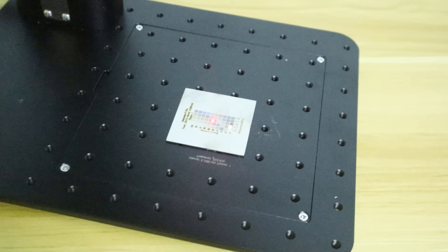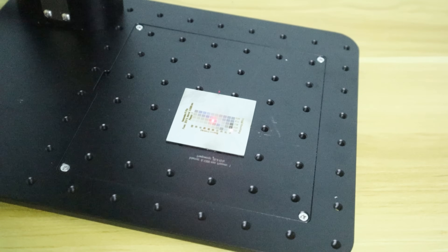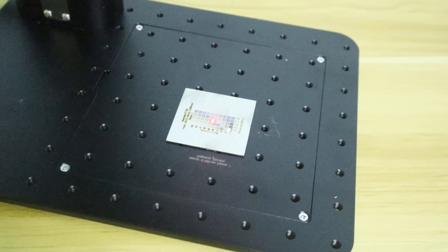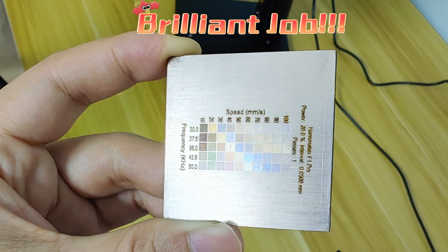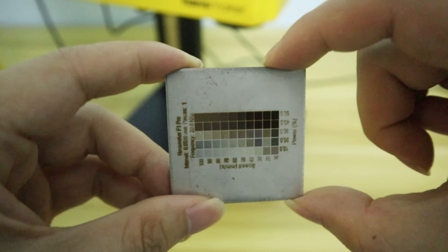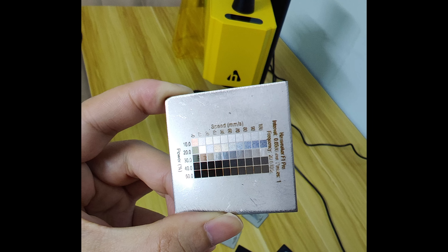I was able to achieve a very rich color engraving when I set up the test with the following parameters: laser power at 20%, interval at 0.05 mm, one pass, speed from 10 mm per second to 100 mm per second in 10 groups, and frequency from 20 kHz to 50 kHz in 5 groups. As you can see, the Handsmaker F1 Pro has done a brilliant job — it produces rich colors on stainless steel. I also tested the effect of speed and laser power on the color of stainless steel, and found that with laser power below 30%, different speed and laser power combinations can still yield rich colors.